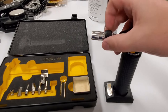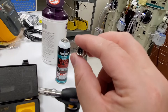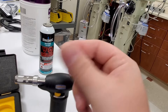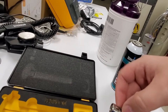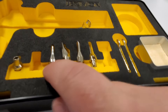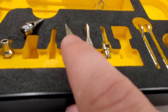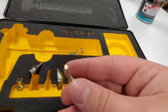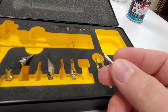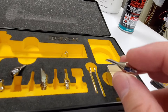Let's go ahead and show you how to change out the tip. Right here is a removable nose cone, and right here is an adapter. The adapter actually has something inside it which is going to react and focus the heat. That piece fits inside the nose cone — you screw it down, and this is a threaded adapter so now we can put one of our soldering tips on. There is a tapered soldering tip, a hot knife good for removing labels or shaping plastic, and this is one of my favorite soldering tips. This tapered oval really wants to hold solder well. If you're tinning something, use this one because it holds a bead of solder really well and you can run it down an exposed wire and tin it really quickly.